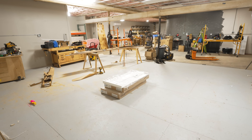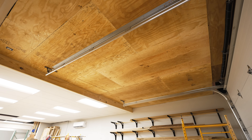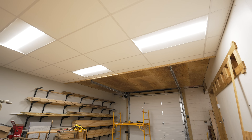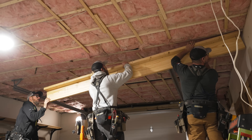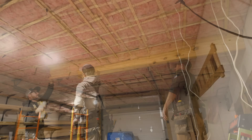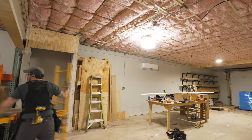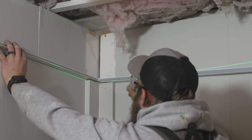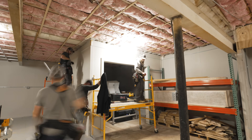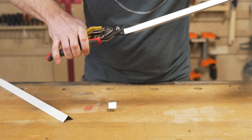With the center section done we shuffled everything out of the way to get started on the right section. There was not enough clearance above my new garage doors to have a drop ceiling above them, so we used a 2x10 for the vertical section and attached that to a 2x4 for adjustability in fastening to the floor joists. We used the 3-4-5 method to square the pieces off the walls. Then we installed the wall molding, dealing with lots of corners including some outside corners. For outside corners you can cut and bend the piece — you'll have a bit of a gap — or you can overlap two pieces to get a mitered-looking corner.